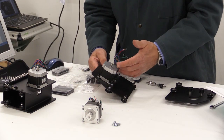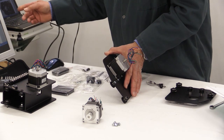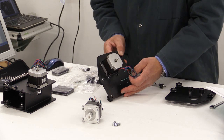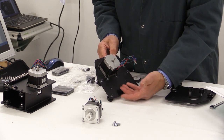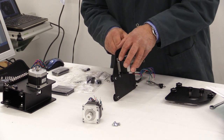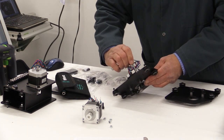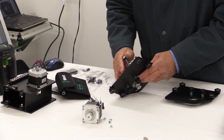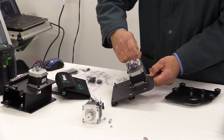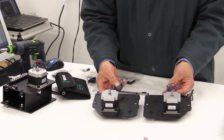Next, we're going to fit the stepper motors onto the Y-plates. Look at the diagrams on the website to see exactly how to do this. The wires are on this side of the motor, the screws go in from the back with the washer, and then we put nuts on each of the four screws. And that's the second one done — if you look at them, they should be a mirror image.